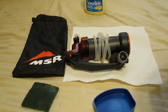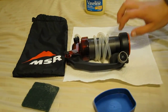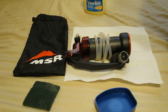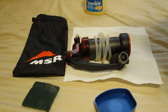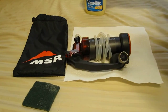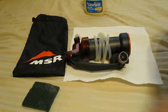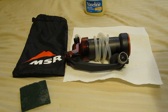One thing I am going to do is, since I've been using this filter out in the field, is boil the filter element. MSR recommends completely submerging the filter element — minus the O-ring — in water, bringing it to a rolling boil for five minutes, then letting it cool and dry for four or five days. Field maintenance is about the same: you wet down your scrubby pad, scrub the element, wash it off a little bit, and stick it back in and go.